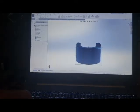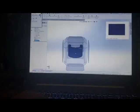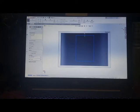All right. Now that I've got this plane going, I am now going to go in here and draw a construction center line, which will go from this spot down here directly perpendicular to this part. Then I'm going to draw a rectangle just like so, and I'm going to find the center of that rectangle right there and right there, just like those two points. And then I'm going to combine those two. I'm going to do the same thing with this one and this one.